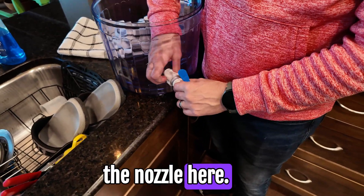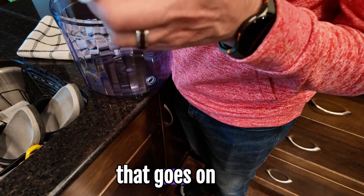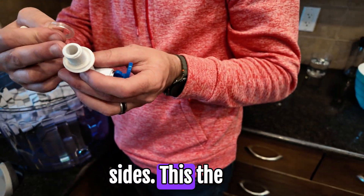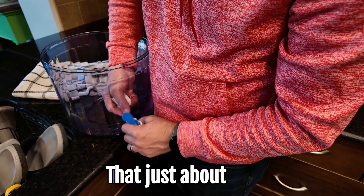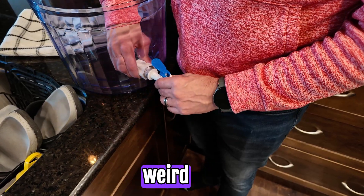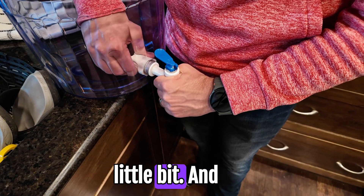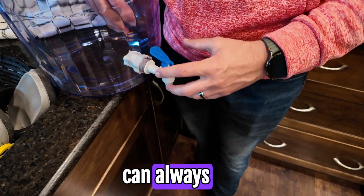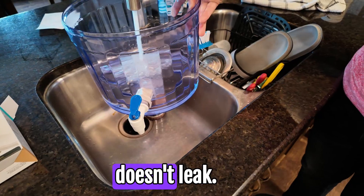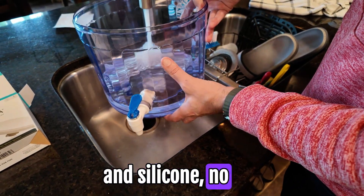Here's the nozzle - it comes with a silicone O-ring and a nut that goes on top. There's actually a washer on there too, so make sure you have a washer on both sides - the threaded tap side and the back lock nut side. Make sure your washers are always flat and not caught on something. As you tighten the back nut, hold it parallel so it's straight up and down, then just go hand tight - you can always tighten more after the fact. Don't over-tighten since you're dealing with plastic parts and silicone O-rings.